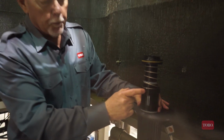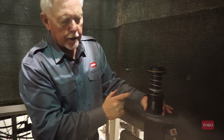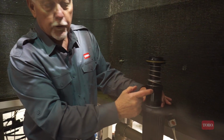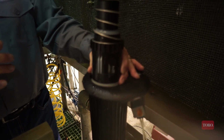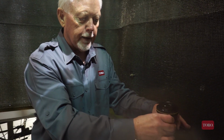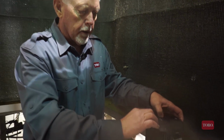Now, one other item to point out is the refinement of the arc adjustment for the left stop is basically 16 degrees between those 2 points. On the Toro ratcheting riser, without having to take it out of the body, the arc adjustment refinement is 2 degrees. So 2 degrees for Toro, 16 degrees for Rainbird. So if you're really looking to get that left arc position refined, Toro is going to provide a much better option. So that's going to drop down into the body now.